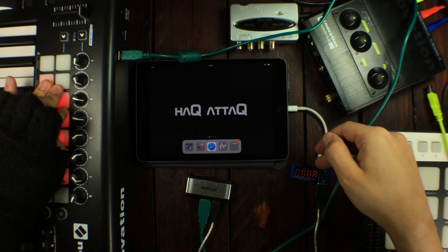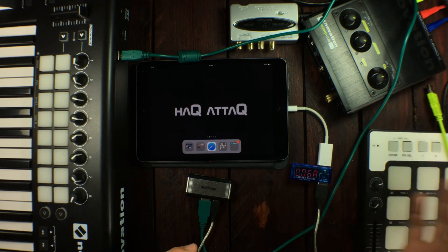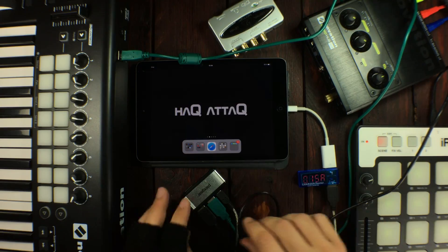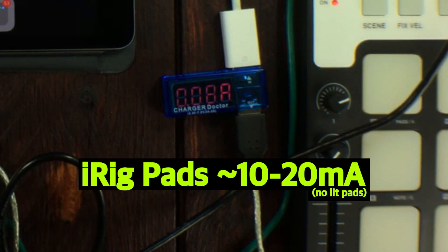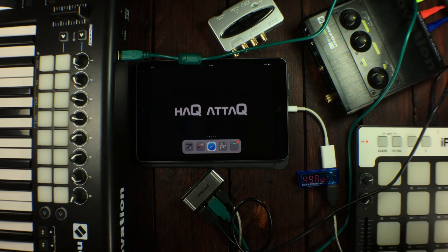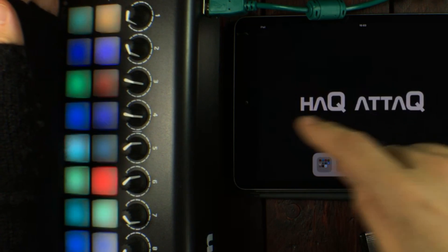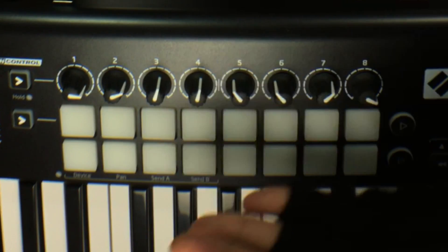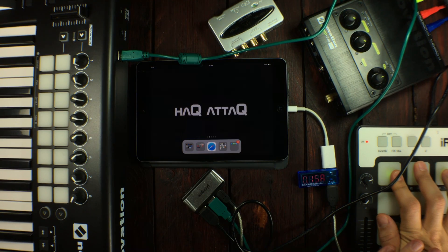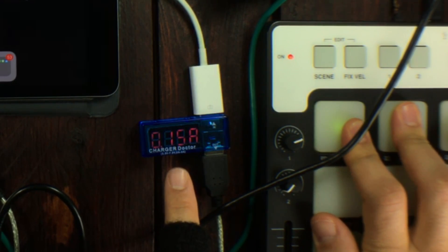We're going to pull more when we press down keys — now we're pulling 80 milliamps, and that's always the thing we need to consider: how many lights do our devices have? So we're going to connect another thing here — this is the IK Multimedia iRig Pads. Let's plug this in and it's going to turn on. We got lights! We're pulling about 80 milliamps from the system and we're still good. LED lights will draw power and the more you have the more power it will draw. If I push down on buttons here we're going to see that suddenly I'm pulling way more — I'm pulling 150 milliamps now from the system.